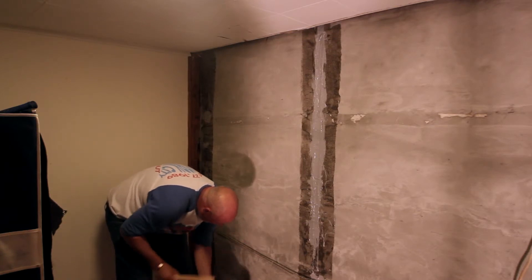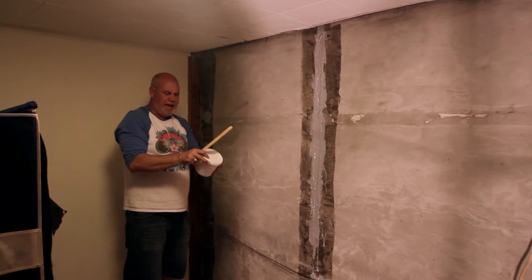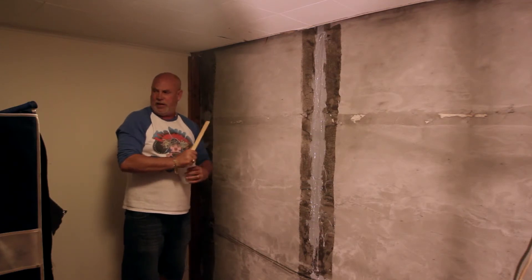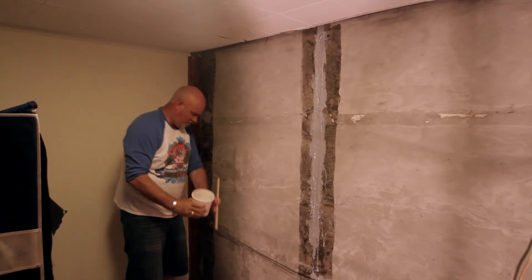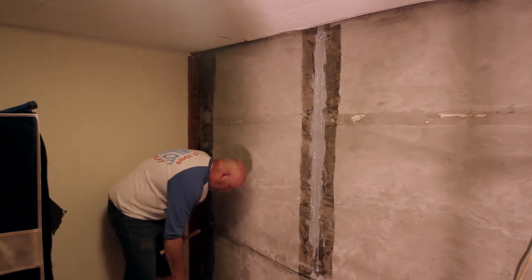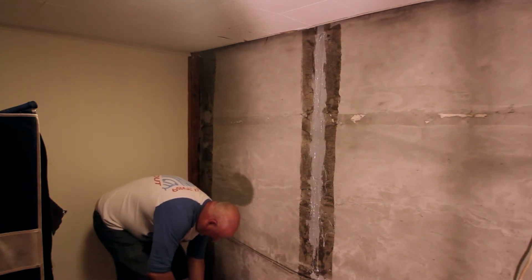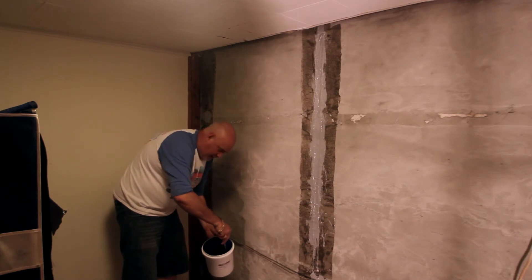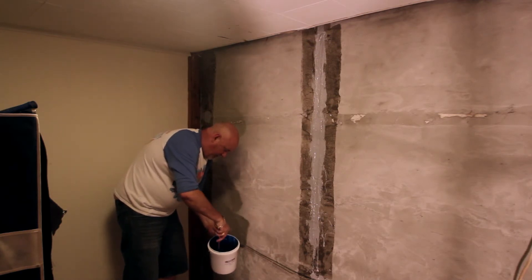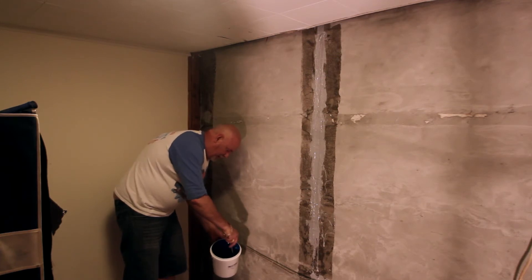Part A is blue, and then you've got part B, which is the additive that forms the second part of the epoxy. This is a clear liquid and it smells obviously awful. I want to tell you — there's some kind of chemical reaction in this stuff that gets it real hot, and I've had these buckets actually melt on me. So I'm going to work with this stuff rather rapidly. I'm going to stir this up for just about three minutes and then we'll start putting it up.